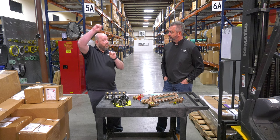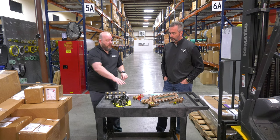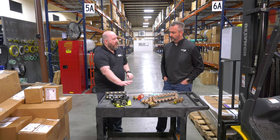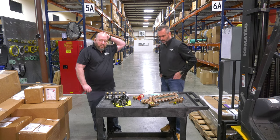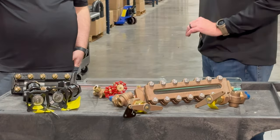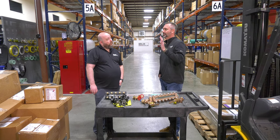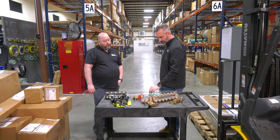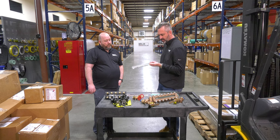You would match the valves up to the application. A lot of times when people call in needing a sight glass they don't know what length they need. If you just measure center to center on those valve connections, we can figure out how long the glass needs to be and which valve set you need. That's your standard glass, and you see that in every boiler room — on deaerators and on the boiler itself.